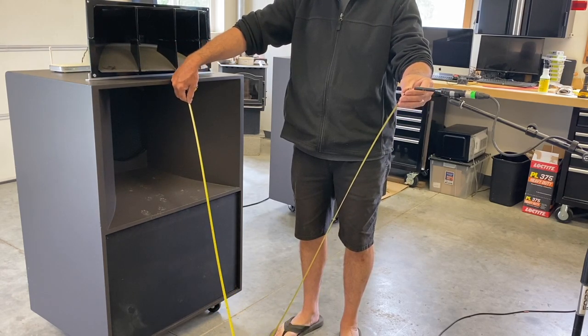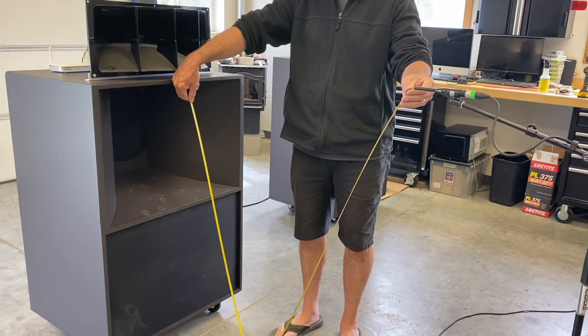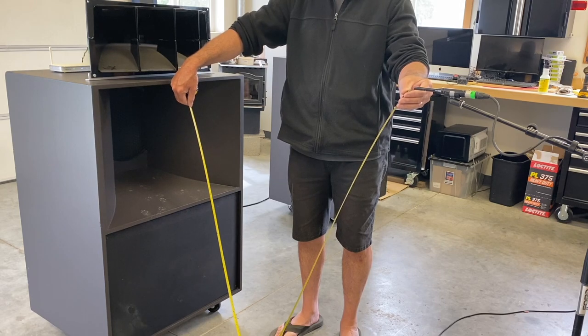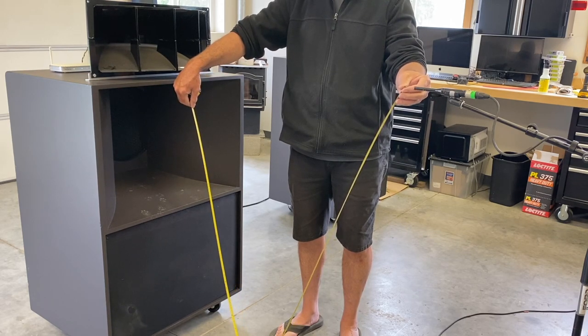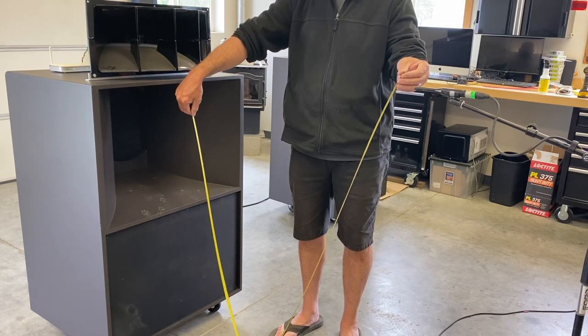So, but there is a caveat, you've got to keep the level pretty low. 70, 80 dB, maybe 6 decibels above the ambient noise of the room. The more you excite the room, the more kind of garbage you're going to get in your measurement. So keep the levels low. If you need to run it loud, take it outside.